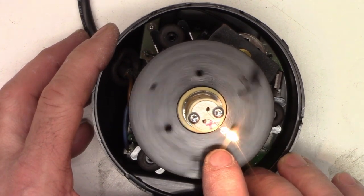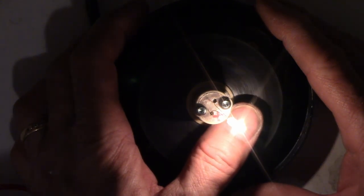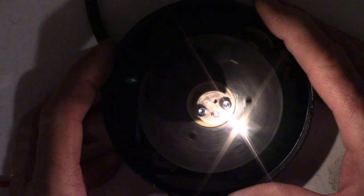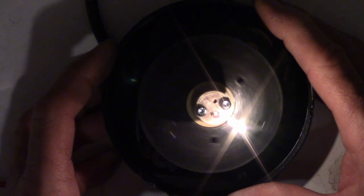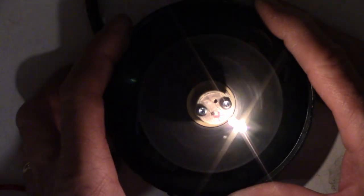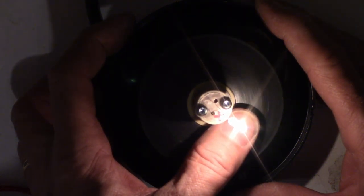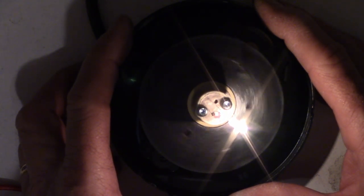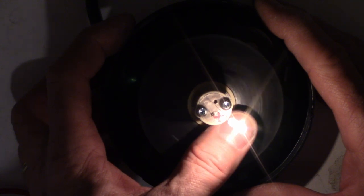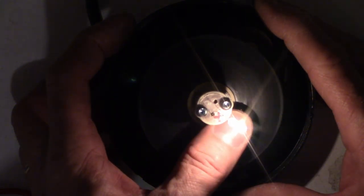Let's remove this, apply power, and turn the motor — and it goes ahead and takes off. Now if you look very closely, right there you can see an optical sensor. So if I block the light to the optical sensor with my thumb, it ramps up to a very high speed, then it shuts off. This thing is a smart, intelligent microprocessor that throttles the motor speed to keep the flasher at the right speed.